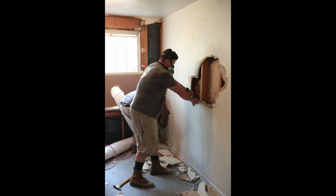All right, so now that you have your 2 doors installed, your door seal kit, now it's time to look at the wall. Usually you'd want to soundproof a wall and not have to rip out the drywall, but in this instance, it's time to rip out the drywall and actually decouple the drywall from the studs by adding something called a resilient channel. But before doing all that, just rip the drywall, remove the drywall. Hopefully the drywall's not even there already, but if it is, you'll have to remove it.